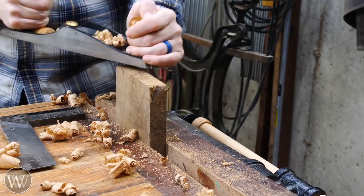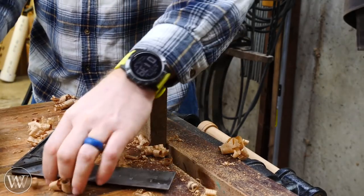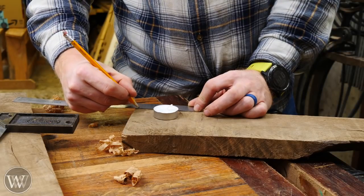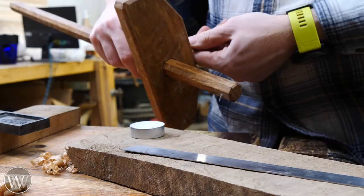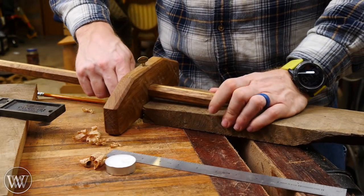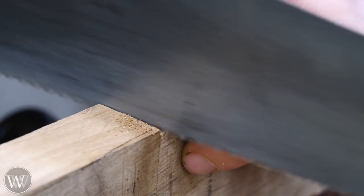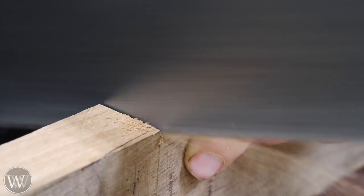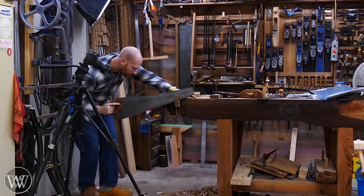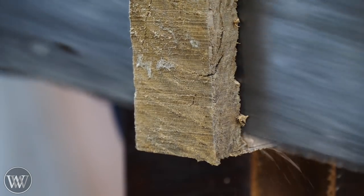I find that I actually like using this freehand rather than doing the shooting board — just a little bit quicker and easier for me. Some people like the shooting board, so if you like it, go to town. Especially with white oak, I find it a little bit tougher to work at the shooting board, so this is easier for me. Next thing I want to do is cut them to their final size — in this case about four inches by about four inches. So I'm going to use the marking gauge, or panel gauge in this case, to mark out four inches from the two reference surfaces. One running long along the board, and one in cross cut across the board, so that we can rip it down to four inches, flip it the other way, rip it down to four inches, and then we have our first piece that is four inches by four inches.